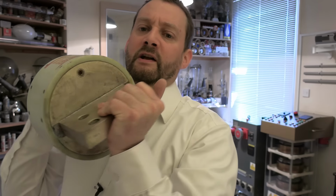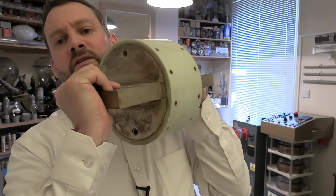So, as I say, if we put 5000 amps through this, nothing will happen because it's designed for 5000 amps. Well, the way we're going to attempt to do this is using a very large capacitor bank. Each capacitor is about 1000 microfarads that will deliver 20,000 amps, 3000 volts, 10 of those in parallel. So we'll end up with approximately 200,000 amps.